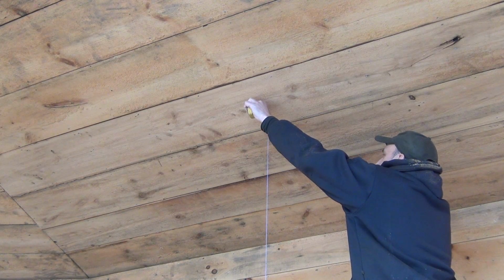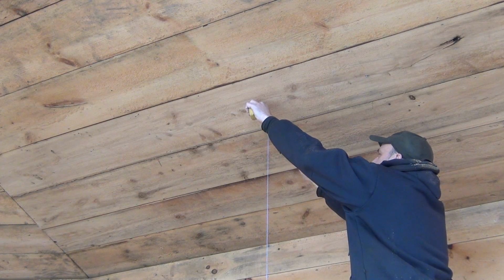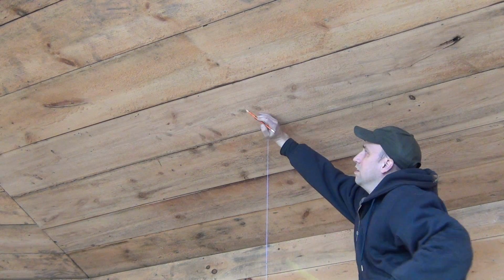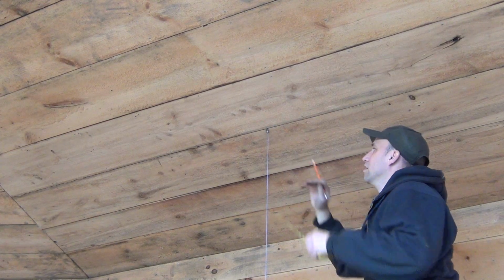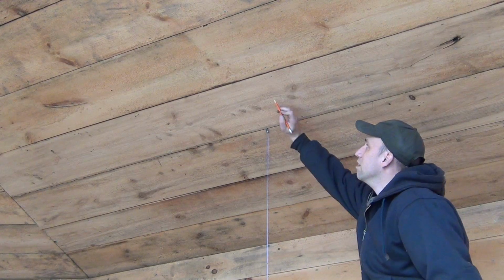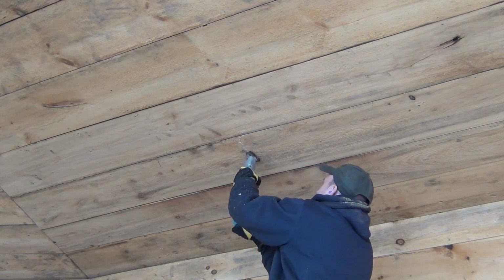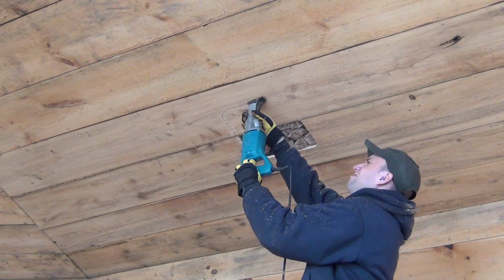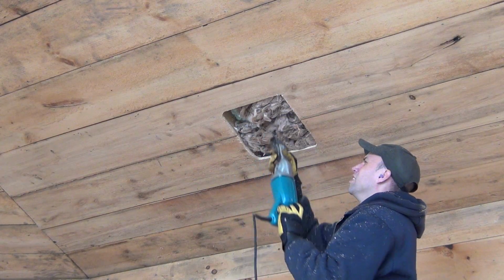Once I determined a good location, I used a plumb bob to mark on the ceiling down to where the stovepipe exits the stove. I went with a straight run through the chimney instead of venting through the sidewall, so there are no elbows to deal with while cleaning the chimney. I'm using a double-walled chimney. It requires 2-inch clearance to any combustible materials, so it goes right between 2 rafters.